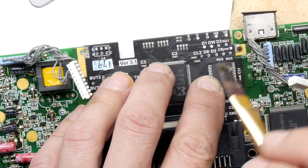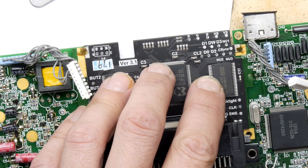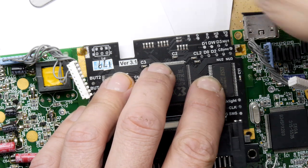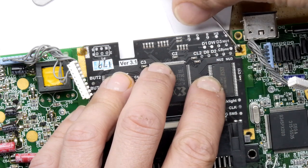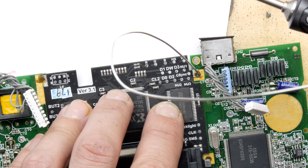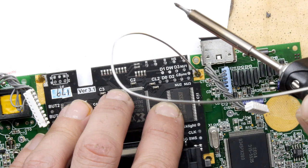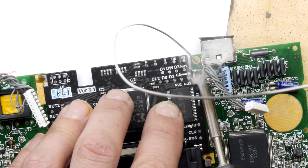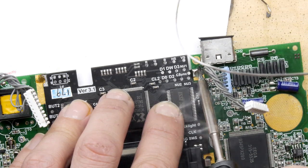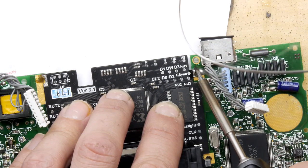The alignment isn't perfect - it certainly doesn't want to align perfectly - but I guess that's as good as it gets. I'm putting a little bit of flux here and here. I need an extra hand. I'll pop a bit of solder across that hole to keep it locked in place. Setting my soldering iron to 350 degrees, and if I hold down the A button I get a turbo boost up to 380 degrees. Just turbo boosting that to get the solder extra hot - coming in with a blob more, and a little bit more. Now we're cooking.